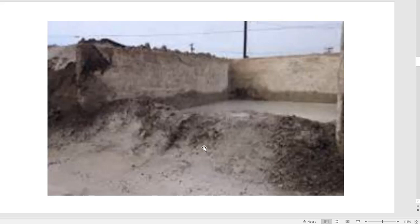This is a drying bunker. Out where I'm at in California, we do a lot of pump jobs. So the pump washes a bunch of water back into the truck and you come back with half a yard, 90 gallons wet. And so then you just make a berm and throw it all in there and wait for it to dry. And then you have to take it over to your drying pile when you get a chance.